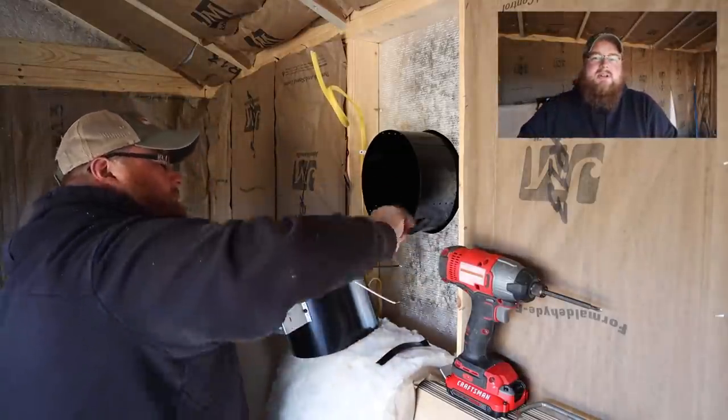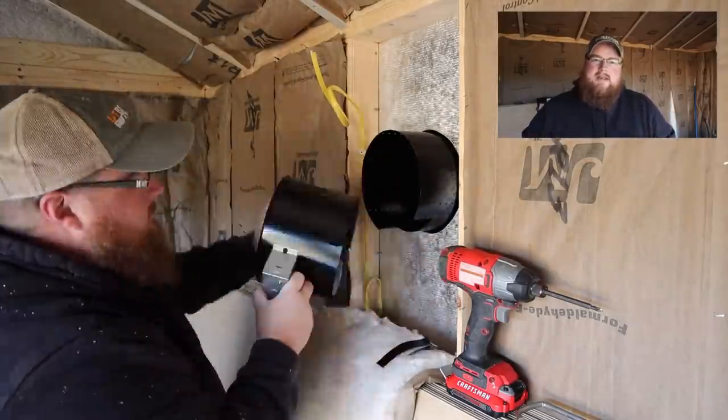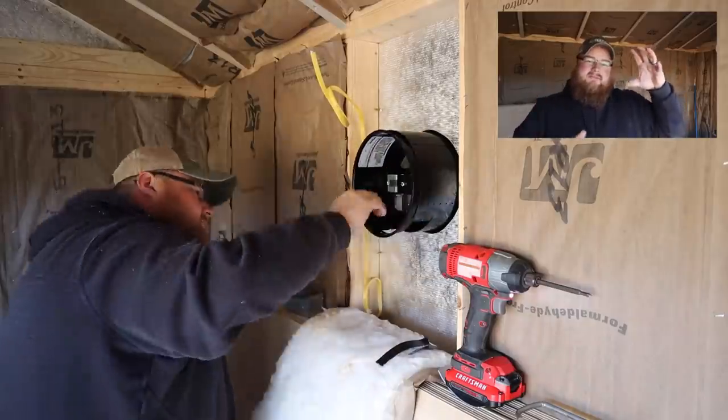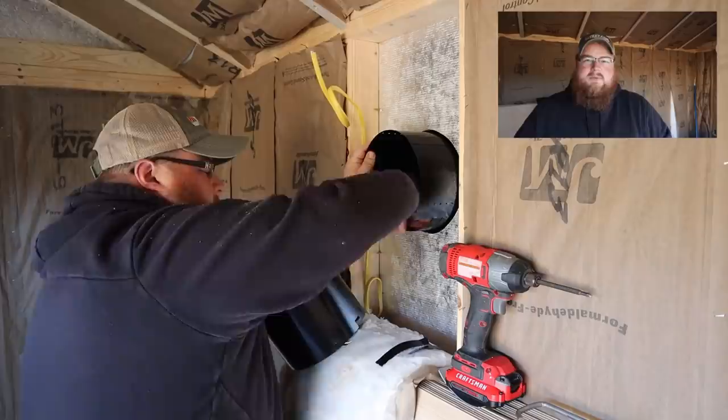On the inside of your structure is where you have to spend a little more time, as far as figuring out the mounting depth for your wall cavity, punching out the little breakout tabs, and assembling the fan unit inside the thimble. They kind of slide together and interlock with a couple of screws.